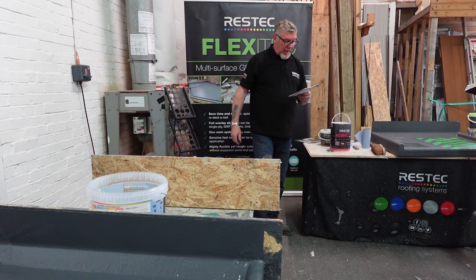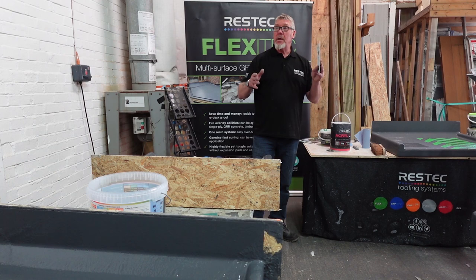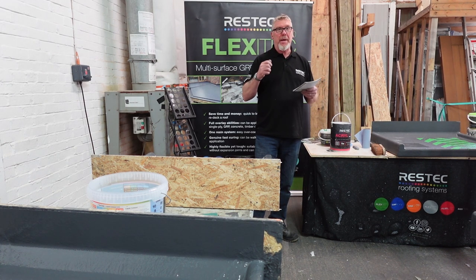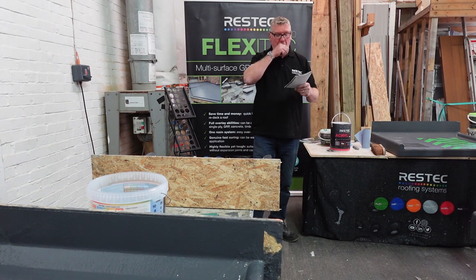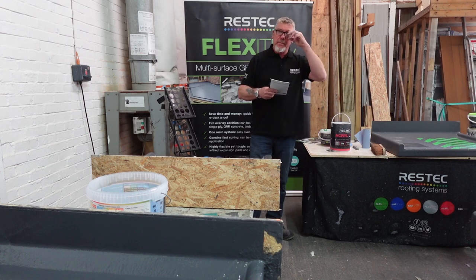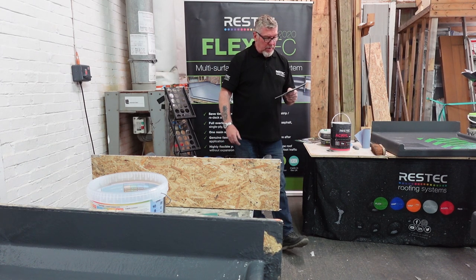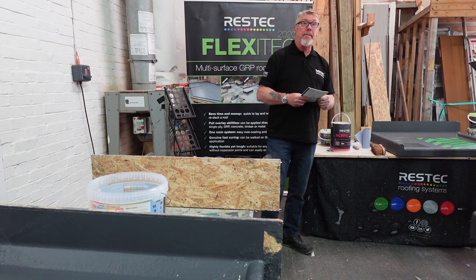Okay. Suitable application temperatures down to 1 degree, we've explained. The resin itself, standard range, 5 to 30. We can extend it, we can take it down using the additive. Don't put different resins together and never mess about with the catalyst mixture, thinking it'll make it go off quicker. If you do, you'll have what I had with that resin this morning. ISOs basically, it does what it says on the tin, applied correctly. Well, today you've learned how to apply it correctly, take that forward, you shouldn't have any problems at all with your job. Okay. Single resin system, repaired, overcoated, yeah, it will work okay.